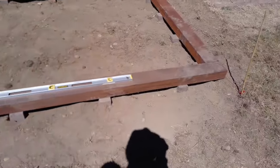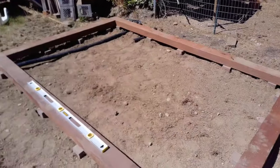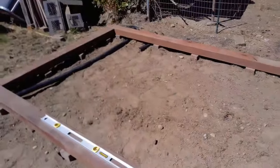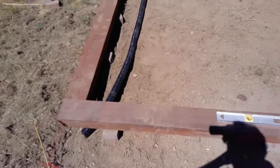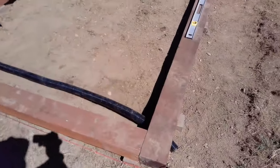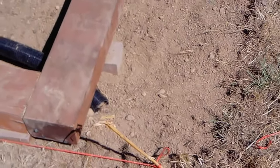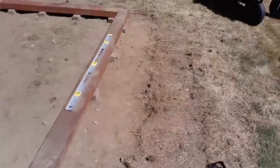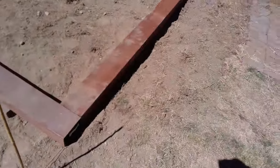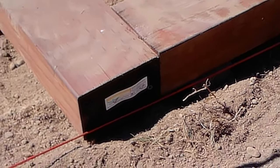I got the foundation laid on this one. I used bricks on the bottom — the bricks are going to keep it off the ground. Then I'm going to fill this with a lot of river rock, basically the same type of rock I have in my walkway. I also put a drainage system into it — perforated holes in plastic pipe to collect any water. It's also going to have an end down here that will pick up the water draining off the front. On the corners I put in screws just to keep it together while I'm building the frame.